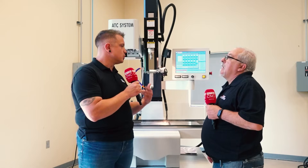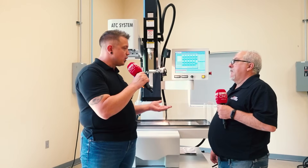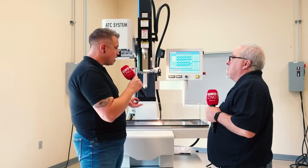The collet system means changing collets for each size, but it allows you to get those bigger holes. The maximum workpiece height on this machine is 12 inches. For larger electrodes, there's an upgraded power supply for higher amperage. Nowadays there aren't a lot of people wanting to drill a 6 millimeter hole in steel, but the application is for thin material or drilling into thin-wall tubing — where using a conventional drill has a really good chance of deforming the tube. With EDM, you don't have to worry about extra cutting forces or damage as a drill enters and exits the material. You just punch it in and get a perfect size, on the first try, in the right location.